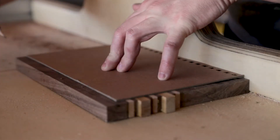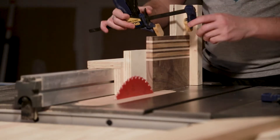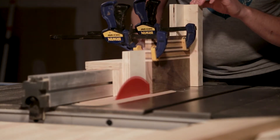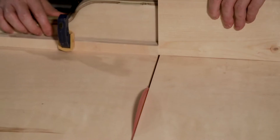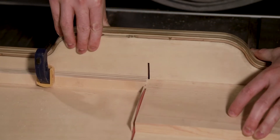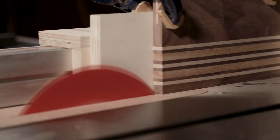Then I traced my covers of the notebooks I bought so I can cut these boards to their final size. To create a bookmatch — many of you could use a bandsaw. Since my bandsaw isn't big enough for these boards I just used my tenoning jig and my table saw. I cut some small pieces out of scrap pine so I could use them to fill the gap made by the blade when I flip them over and clamp them. The only thing left to do is to cut the rest with a handsaw, and then you have your bookmatch pieces.